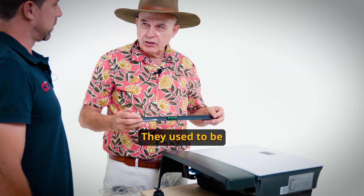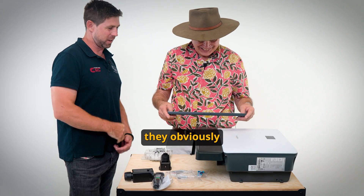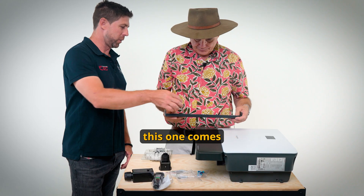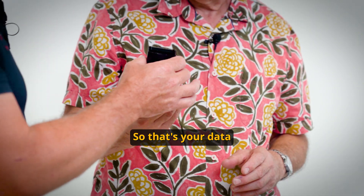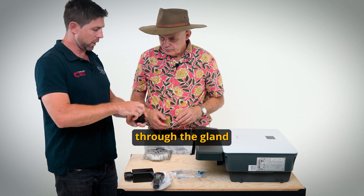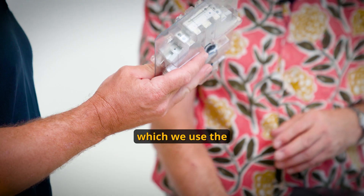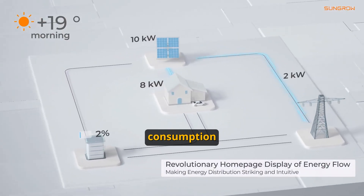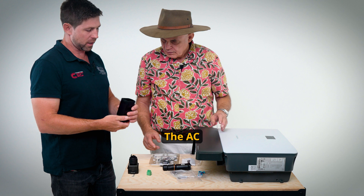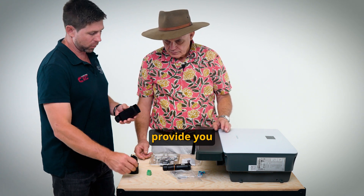That's the bracket we use to mount the units to the wall. They used to be much bigger — nearly the whole size of the unit. These days they use a much higher tensile steel bracket, and this one comes with little levels. That's your data connector — all your data cabling comes in through the gland at the bottom. All the 10 kilowatt units come with a single phase energy meter, which we use to monitor the home's consumption, as well as for export control. That's your AC connector, so your AC cabling comes in through here — it's hardwired into the inverter and they provide you with the lugs.